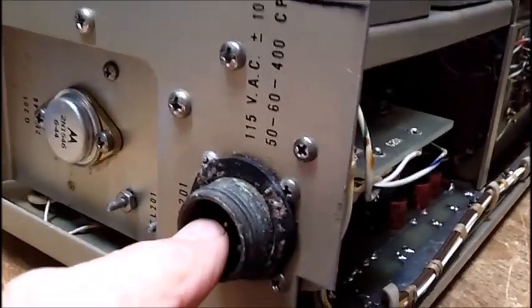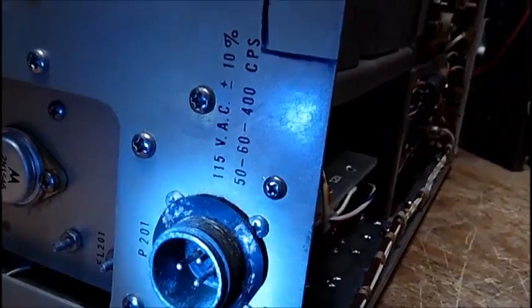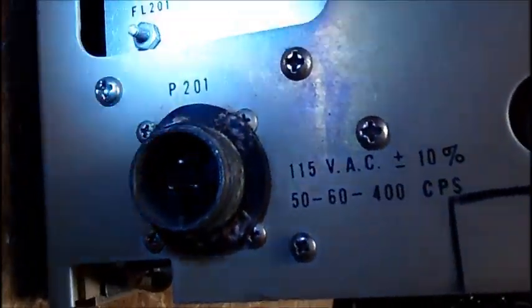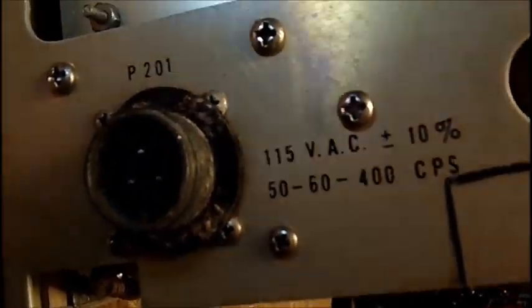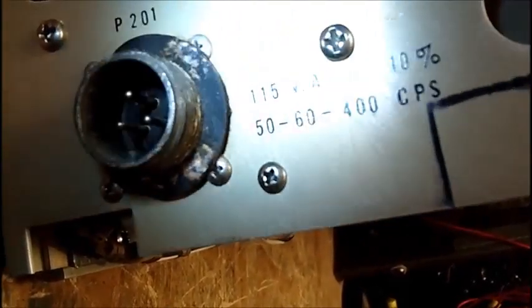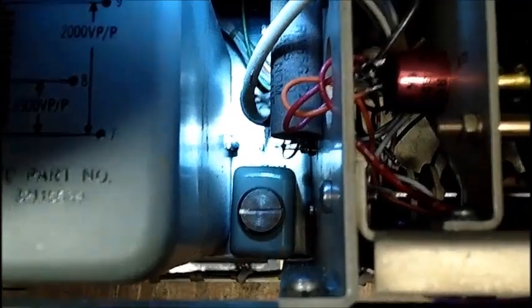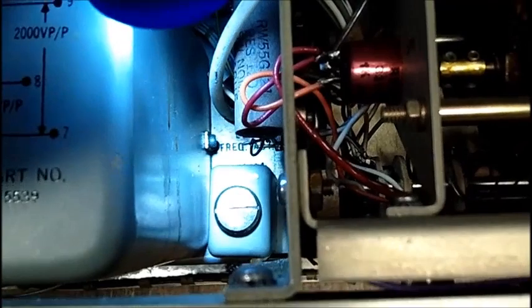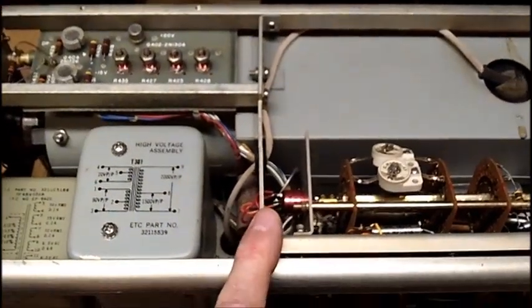This also has a three-pin plug, which is a military-type plug, and it runs on 50/60 cycles or 400 cycles. I don't know — maybe I've got this set on 400 cycles. Look straight down into the top — you see this thing with the screw on it, it says 'frequency adjustment.' I tried turning it but it didn't seem to do anything. I thought maybe this thing is set for 400 cycles and not 60.